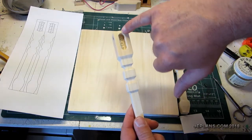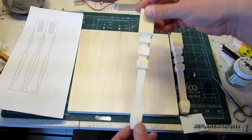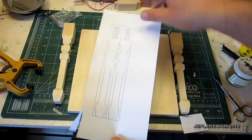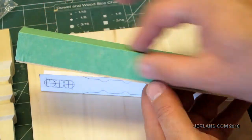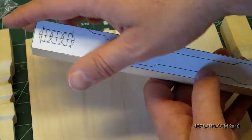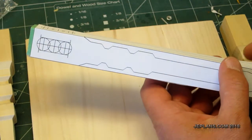When I move the drill spots further this way and this way, that will be covered up by the piece that goes in at the end. The leg itself is compound scroll. This is the pattern — I'm going to apply it to the wood and cut it out. A quick note about attaching patterns with the scroll saw: typically I'll put on some painter's tape first, then use a glue stick and glue the pattern right on the wood. I sometimes get questions about that when people buy my plans and don't realize the patterns are to be attached to the wood for cutting out.